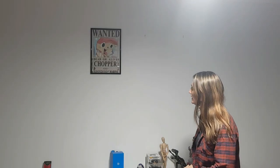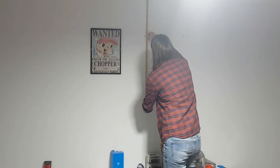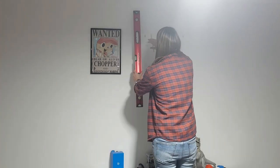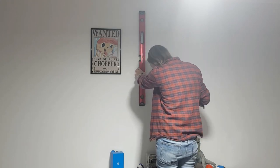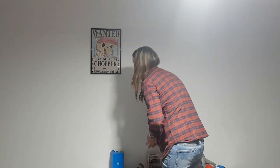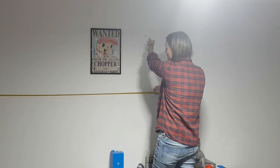I'm going to start again in the middle, so I want it to come out at that 2.25 meter mark but the other way. I can come straight down from this and then use my level to make sure I've got it straight underneath it, so I'm just going to measure out 90 centimeters to start with. I'll grab my level, put it up against that, get it so the dots are right in the middle. Just to be on the safe side I'm going to measure over from the door frame - I've got a helper - and we're spot on the 2.25 mark, which is exactly the same anyway.